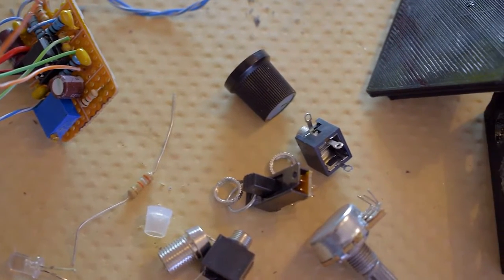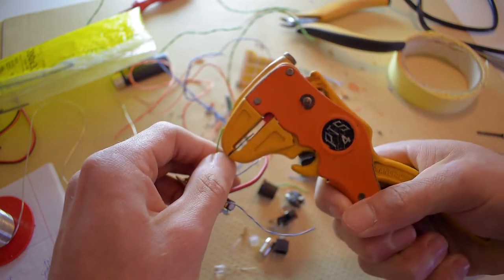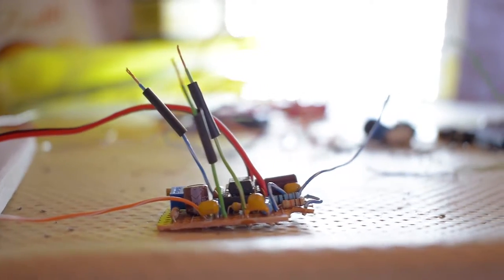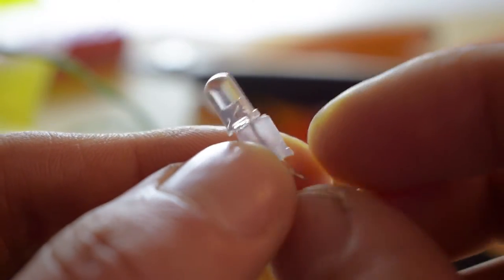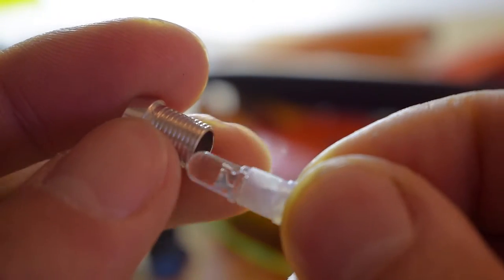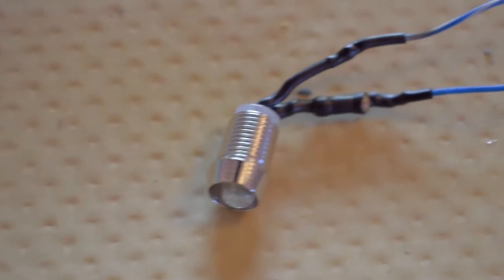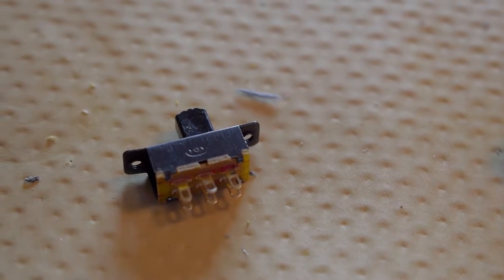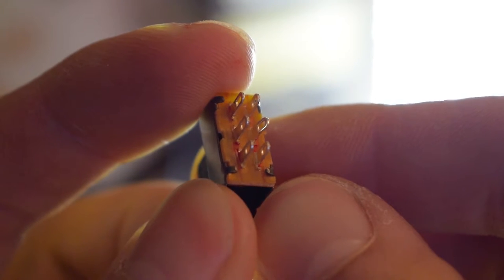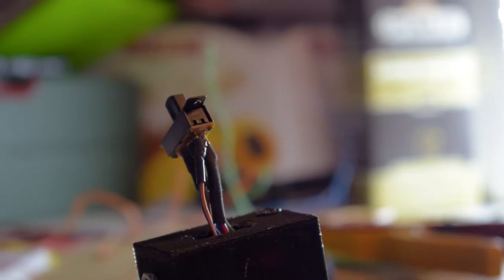It's time to connect everything together. After stripping all cables and putting heat shrink everywhere, the first component to solder was the potentiometer. For the power indicator, I used an ultra-bright green LED with a 39kΩ resistor in series — it will make a lot of light even drawing only 230 microamps. This slider switch has two independent switches inside: one will be used to cut off power to the amplifier, and the second will allow for signal bypass when no amplification is needed.